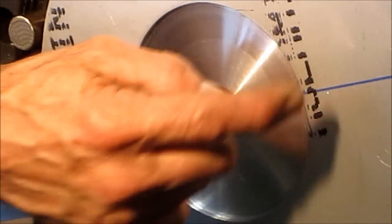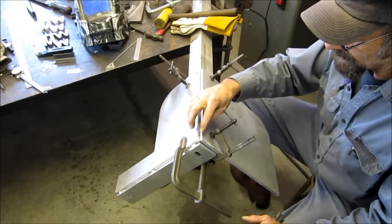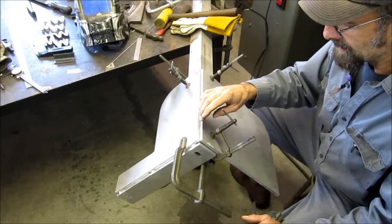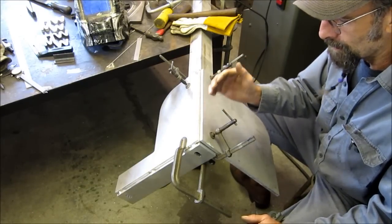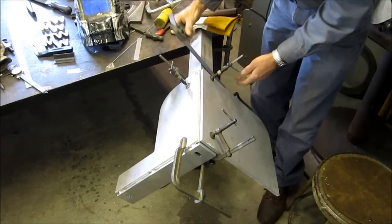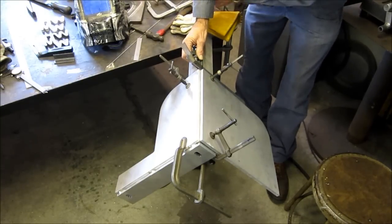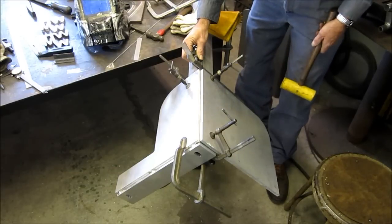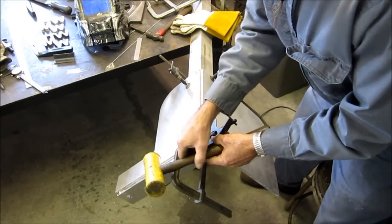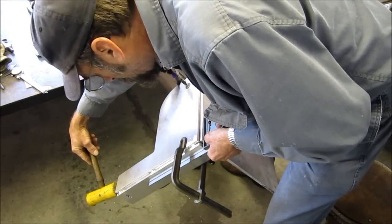All right, ready to put the four-hole pattern in here. This is the typical weld seam that I like to put, and I like to give it a hundred percent weld penetration around this corner. This kind of welding does not distort or pull as much as a butt seam. To make sure that this plate is square in line, I use the angle — this is just a two-and-a-half-inch angle iron, stainless steel, 3/16 wall — and I go ahead and tap my plate up or down to create that square line.